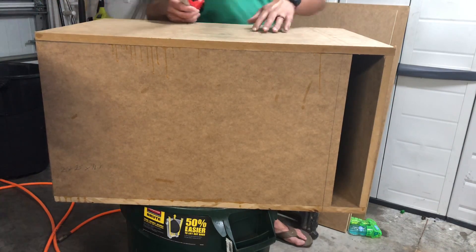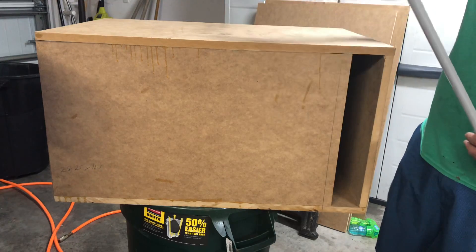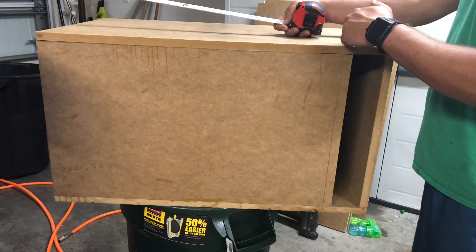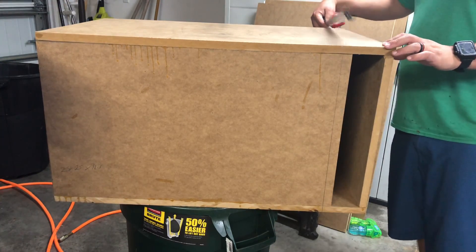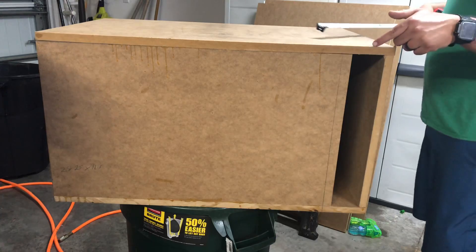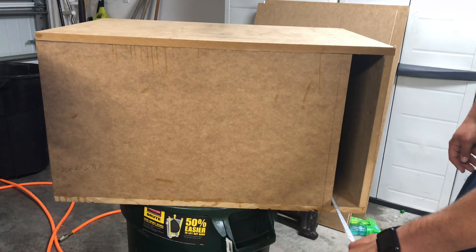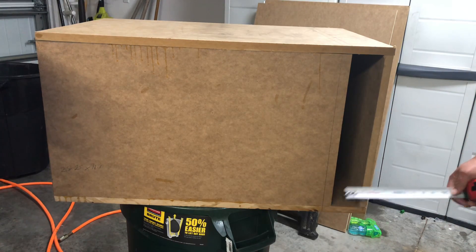This is the top plate — front, back — you can mount your subs front, top, bottom, or back, and this box will rotate since there's no pre-cut hole. Looking down from the top: 32 inches wide, 20 inches deep, 18 inches tall. The port core is going to be 16 and a quarter inches, and the port width is going to be 3 inches.